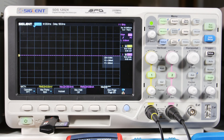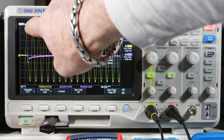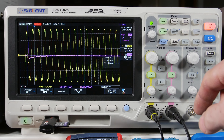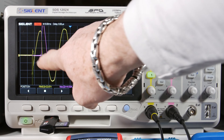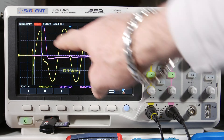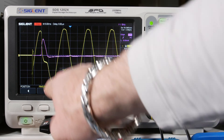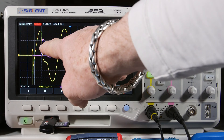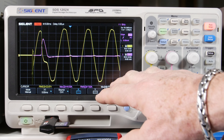I'm plugging in the power cord — that beep was from the power meter — and I'm ready to hit the switch. Wow, sure did capture something. Let me zoom in on that huge spike right here. I can push the button and it centers the trigger. Look at that pulse — it's off the screen, but this scope doesn't clip the waveform. It reads 44 amps — that's two divisions at 20 amps per division. This is a really interesting shot.